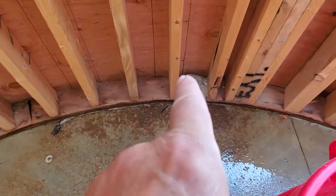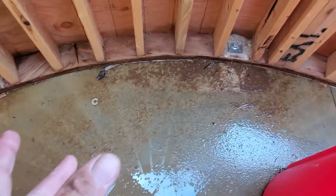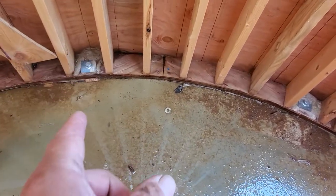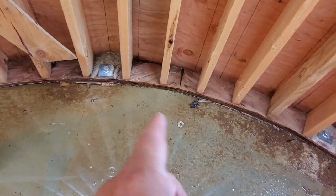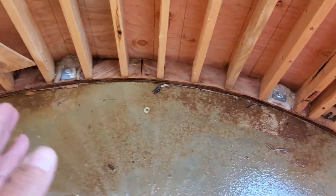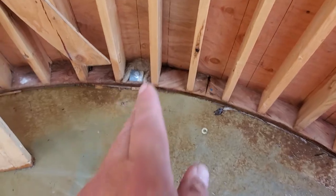You see all this water sitting in here from the rains — that's causing us some issues. You see how it's bolted in; it's actually starting to delaminate on me and deteriorating sitting in this ring. They'll get it buttoned up hopefully and get this taken care of, but they're going to have a lot of problems on this bottom plate because it's going to rot away sitting on concrete even when it's dry.